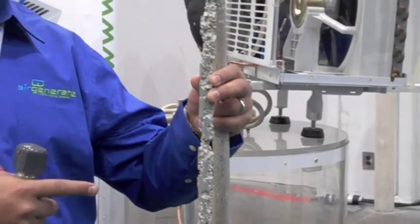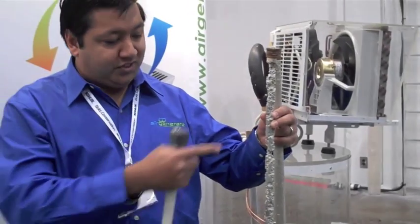As long as you have a good anode rod, your tanks will keep on going. Once this gets fully depleted, the corrosion starts attacking the walls of your tank, and that's why you have tank failures at six to ten years.